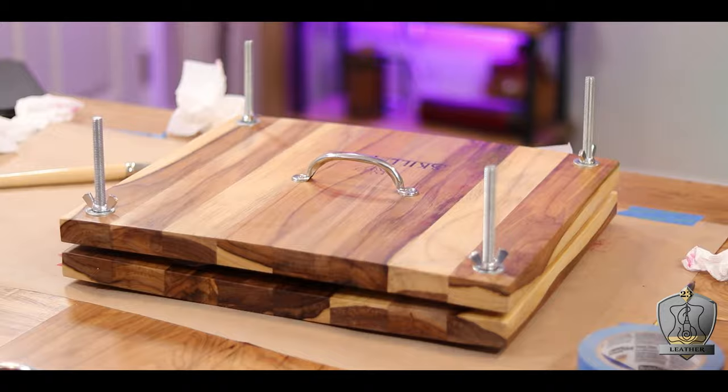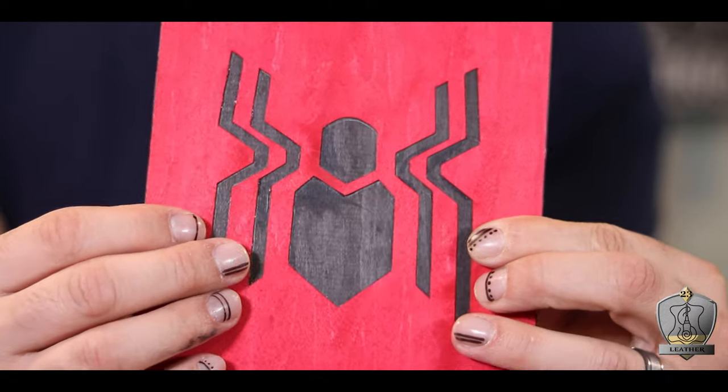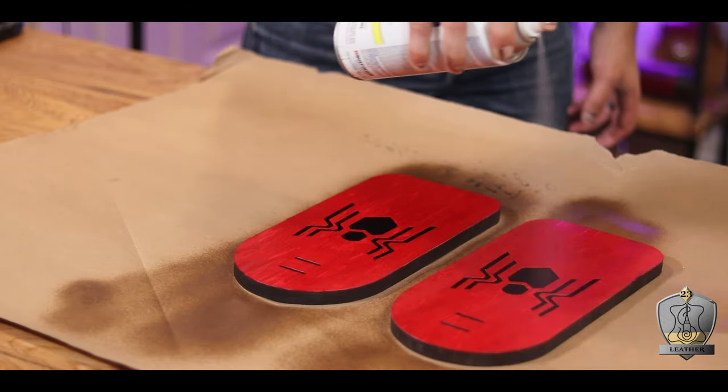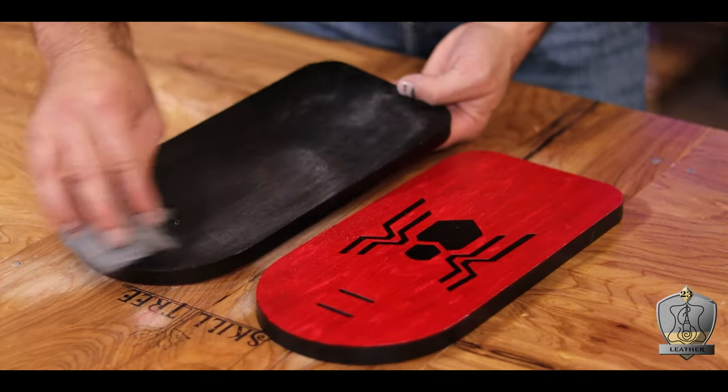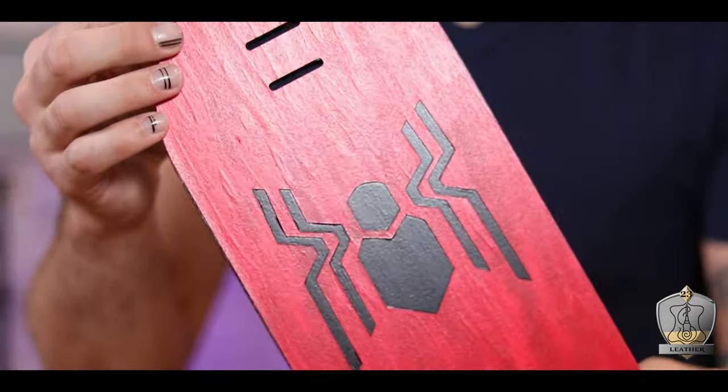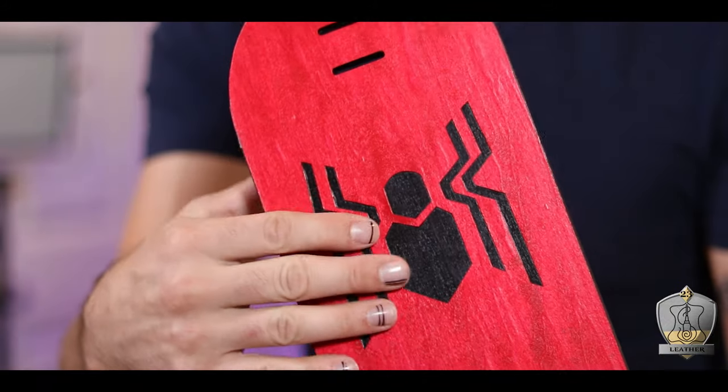Time to check on how these came out. Look at how these came out — they look perfect. This was a really good idea. I could not get it that perfect if I carved it, so the fact that it looks this good off the gate, I'm so excited. To seal these up, I'm just hitting them with a semi-gloss clear coat. I also sand in between each coat with some steel wool just to get it as smooth as possible. This gives me this really beautiful, low-luster finish that I am just obsessed with. I think I can safely say those sides are dealt with — I'm very happy with those.